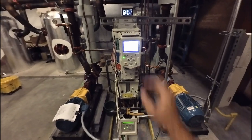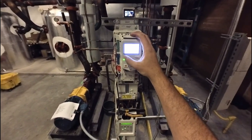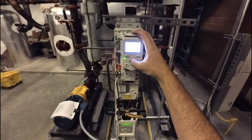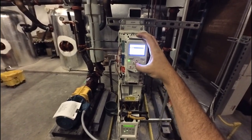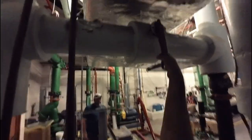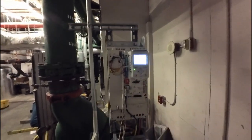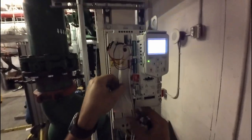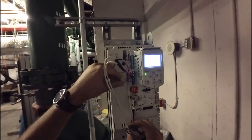This time I made sure to turn the chiller off first, then shut the drive down, move the wires, and gently turn it back on — it tends to appreciate that a little better. Always make sure that if you manipulate things as part of your testing, like opening that bypass and closing the isolation valve at chiller 2, you put all that stuff back. Sometimes we get in a hurry and don't think about those things, but it's a really big deal. It can give the customer a bad experience due to a technical failure they didn't have to have. Always take a moment, look around, see what hasn't been put back, and make sure it's exactly how it was before you started.